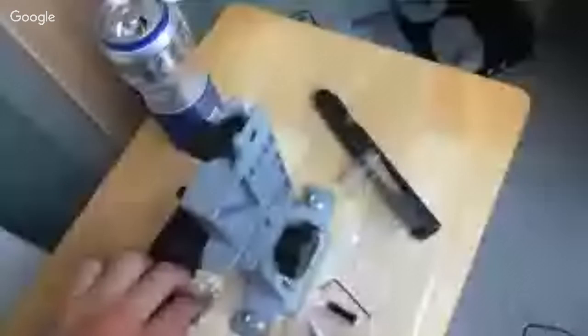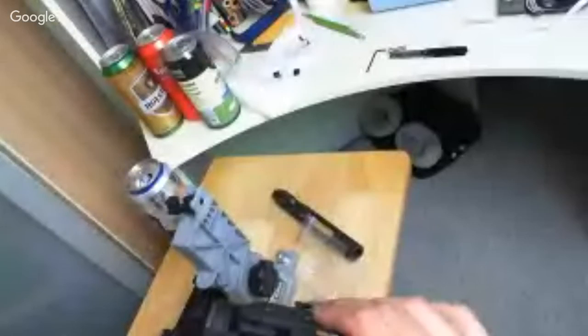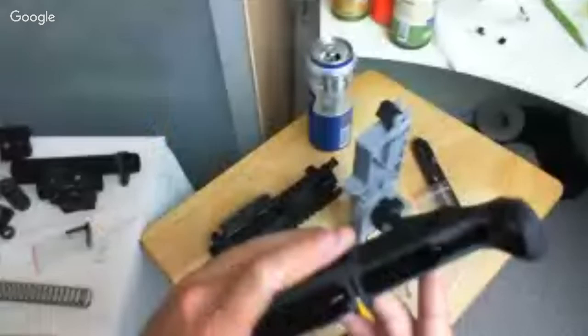Get in the back, and then let's grab the other spring. Now, just a thought, your end plate for your receiver is what's going to hold in that second detent, which means you're going to need to put your buffer in, which means your buffer might be in the way while you're hammering in your mag release, or not your mag release, but your bolt drop. Yeah, I could leave that guy out for now. Why don't we? It's not undoable. You'll have that buffer to go past when you're trying to bang in your other roll pin there. Yeah, that's a good point.